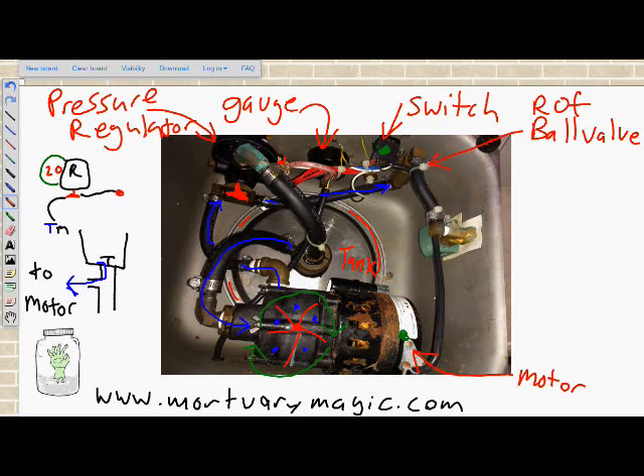If you totally close that valve, you may ask how the regulator keeps from blowing up. It's very simple — the third opening on the regulator is responsible for returning fluid back to the tank. Everything in excess of 20 pounds of pressure returns back to the tank. Fluid leaves the regulator and returns back — all the excess above 20 pounds of pressure — and in support of this, from the regulator, fluid travels up.